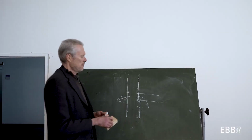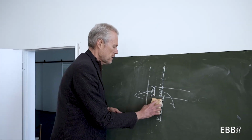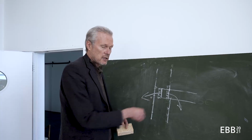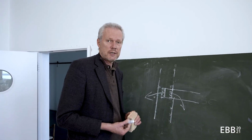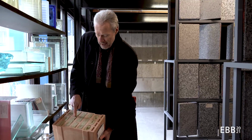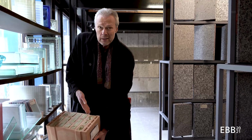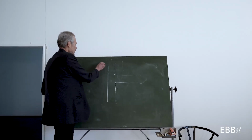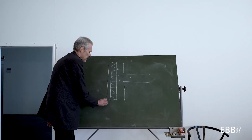What some people are trying today is to use massive wall building materials that incorporate the insulation. So in this case, the building material is so insulating that I don't need a specific insulation in addition to this. And in this case, the mineral wool insulation is in the inside of the brick wall, so you don't see it or feel it on the outside, but it's incorporated in the brick. So today we are going to treat the exterior insulation and then the protection of this exterior insulation.